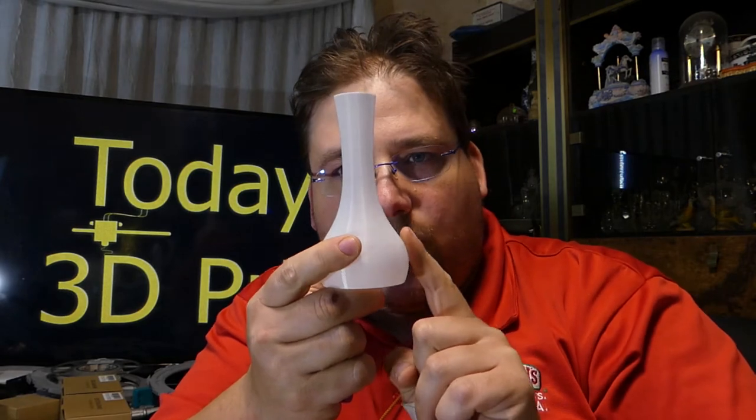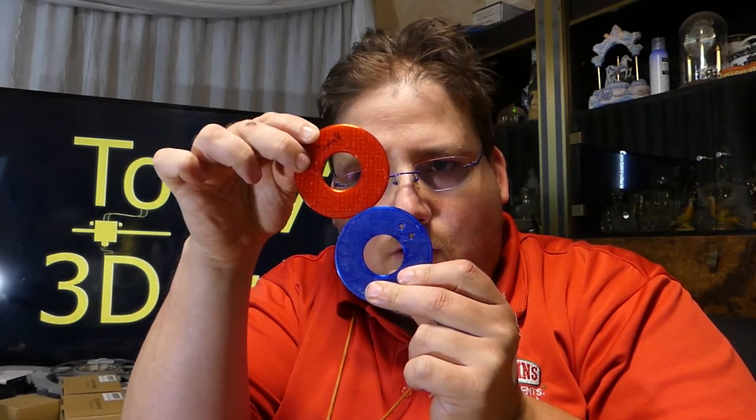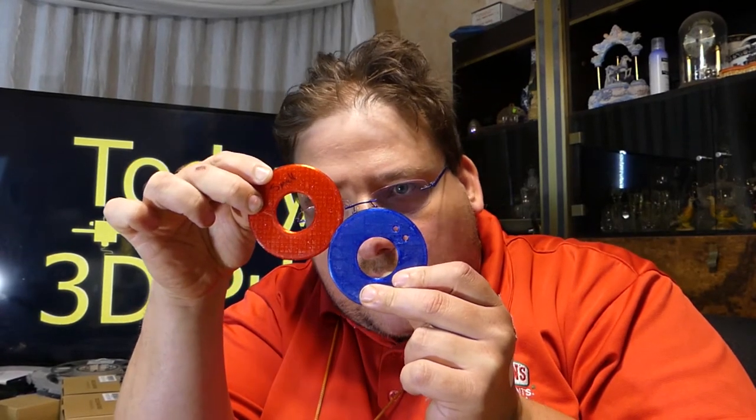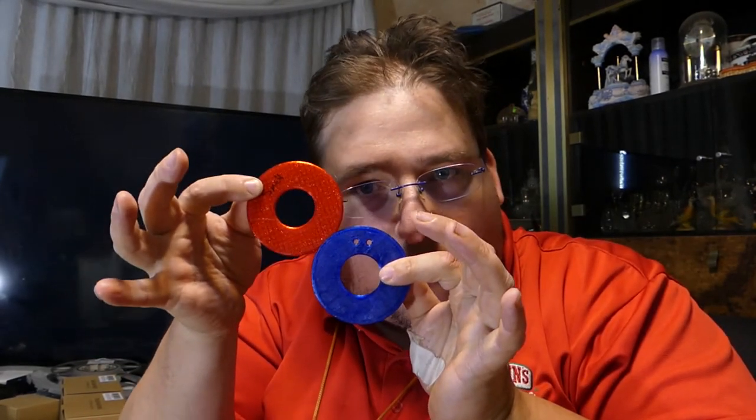So his print was failing because it was a very acute angle vase. This is a very shallow angle vase. But the spiral vase is a very acute angle vase. The angle is like this. So when he had it up so high at 0.25 millimeter, when he shifted over like this, oops, see, there's a gap. Remember, you can't go over and down, because now you're moving into your previous layer. You have to move up 0.25 and then move over to make your curve. Now, if you only move over a little bit, such as this, you're fine, it'll still work. Your wall might be a little thin, the connection might be a little weak because you're approaching that point contact,